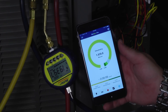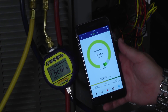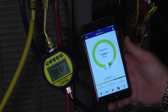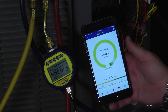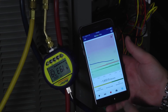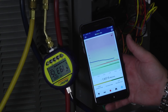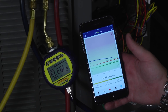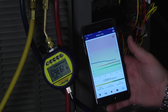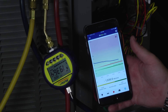As the time has kept running, you can see we're no longer in the third stage of evacuation. We're actually in the dehydrating zone, which shows us that we're removing moisture. You can see the moisture coming out of the vacuum pump — that steam, that's the water, the moisture as it boils off. Let's go back to the chart, and you can see that blue line dropping closer and closer to our target rates. We're still not there, so let's give it a little bit more time and see what the BlueVac Micron Gauge will do as we monitor and track the status of our evacuation.